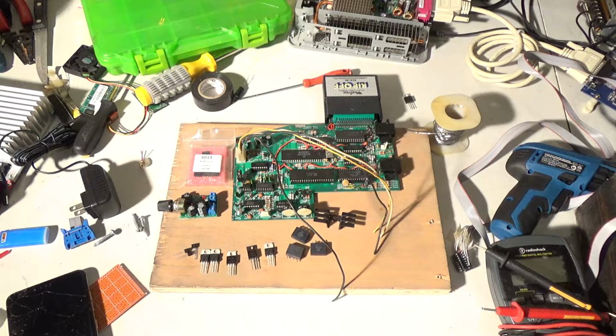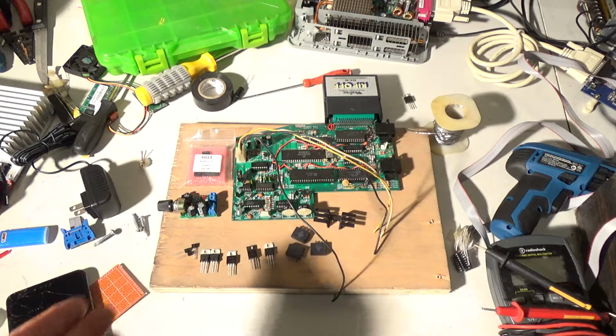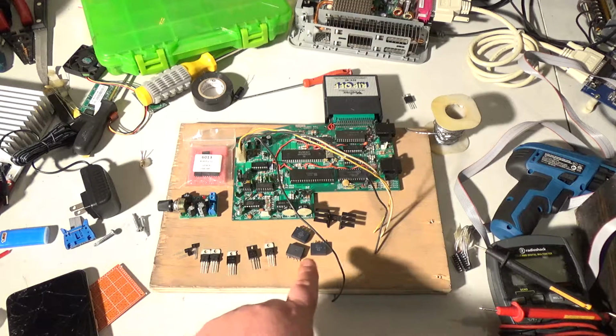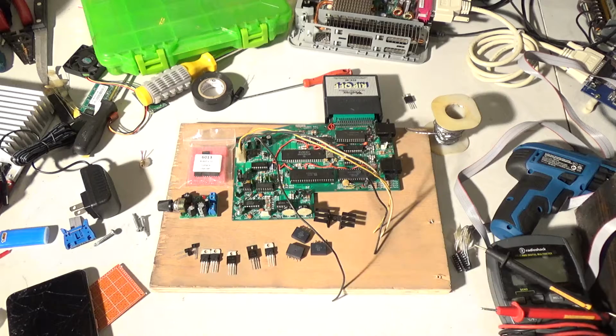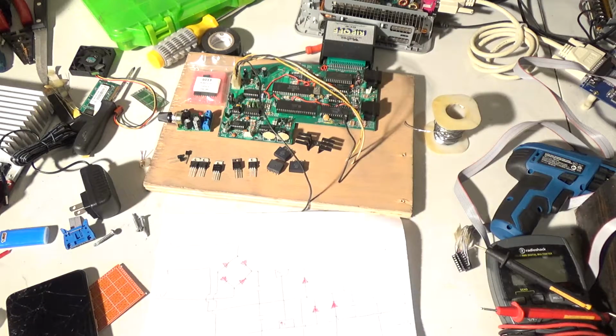See, the deflection board that I'm going to be using will be built into the 36-inch monitor, so I do not need a deflection board. The only thing I'm missing here is power and sound. So I'm going to make a simple circuit. I'd laid out some regulators here and some full wave rectifiers and so on, but I'm going to make a simple circuit. Let me move this out of the way a little bit. Right here. Let me zoom in.